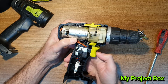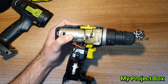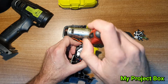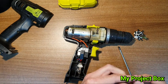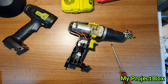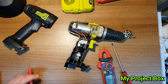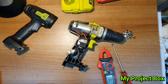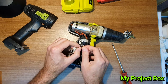Right, I know that the motor works fine, so the MOSFET over here could have failed. Maybe this lighting contact in here isn't working as it should — maybe it needs cleaning. Let's test the MOSFET out. That does not bode well; it shouldn't have continuity across everything. So let's take the MOSFET out of circuit so we'll know if it's the circuit affecting the reading. It sounds like the MOSFET has shorted out, so it's probably gone.